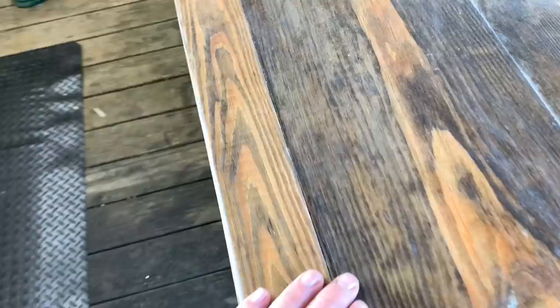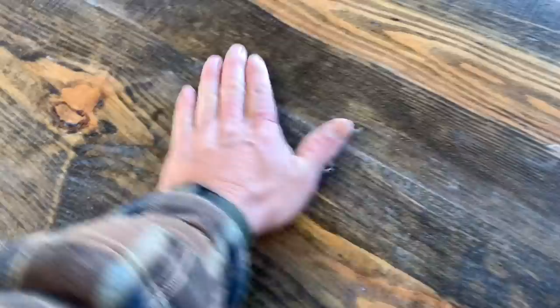All right, y'all look at that right there. Now that's one coat of that urethane that I put on there yesterday, and what I've done is I've gone in there and scuffed the whole thing, sanded it with 180-grit sandpaper. That's that white stuff that you're looking at right there.